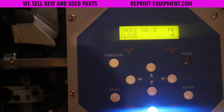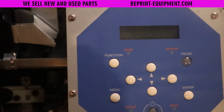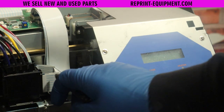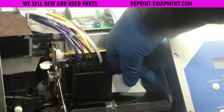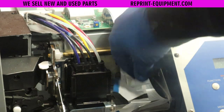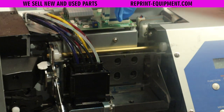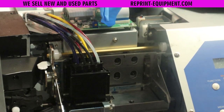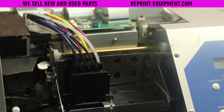Very important — and as good practice, go ahead and hit the power button a few times to make sure we discharge any electricity that could be left in the machine. Before you jump right in and start taking this apart, it's very important that we remember the correct orientation of these head cables, and it's very important that we pull them straight out so as not to bend any of the connections. I recommend taking your camera out and snapping some pictures. Also a good idea to take a permanent marker and write one, two, three, four on the head cables so you know exactly where they go back. I've seen many people struggle with this, have them in the wrong way, get lots of errors — and you can really ruin a brand new print head if you're not careful. Now that I have the head cables removed, I'm going to tuck them behind the machine so they don't get in the way and no ink or cleaner gets on them.